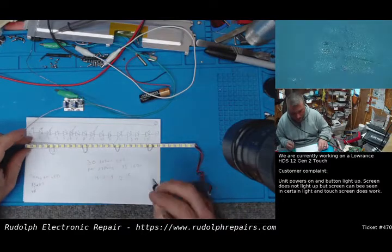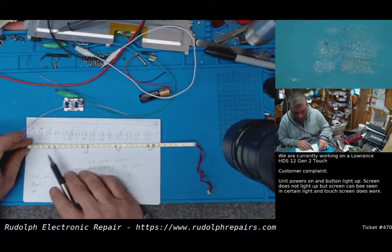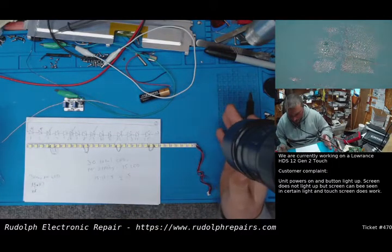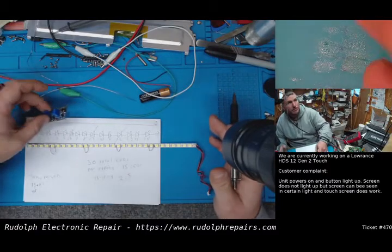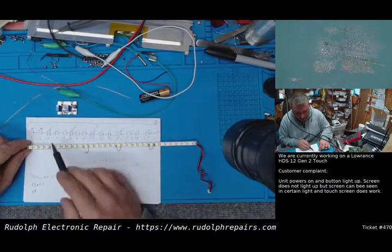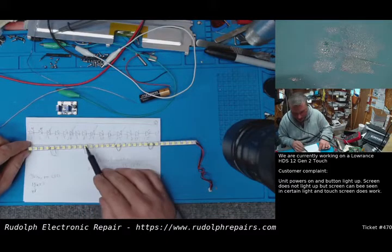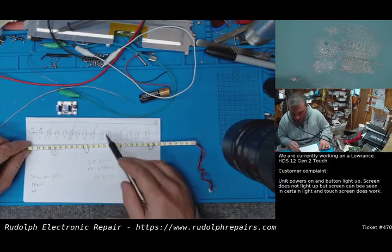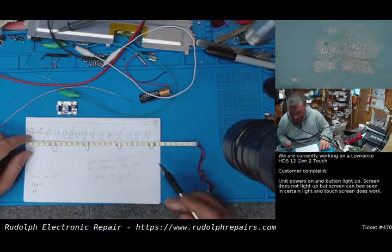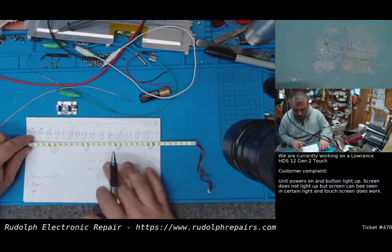So just a quick recap, what we did is we shorted four LEDs to bring our overall required voltage down to something reasonable that one of these boost converters can supply. So LED 1, 2, 3, took it out of circuit, 4, 5, 6, out of circuit, 7, 8, 9, out, 10, 11, 12, out. Which brought us down to 11 LEDs, because we took 4 out. 15 minus 4 is 11.